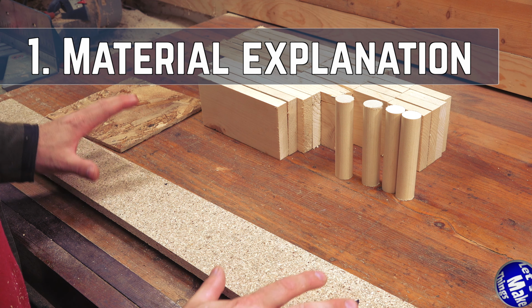Okay, we still have the last 2 boxes to put on. But before we go any further, I want to show you a little problem that I ran into. Despite my best effort, I still have a problem with the wood extending beyond the rails here. Now, I could get mad and I could just throw this entire project away. Ultimately, what I'm going to need to do now is I'll take a ruler and go across here and then just keep sanding and being really careful not to touch the rails.